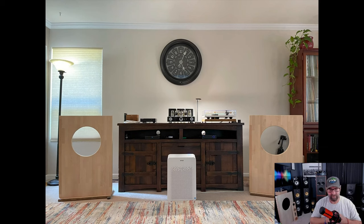So we're going to move on with this project and do some really cool things. We are going to be beveling the speaker hole at about 45 degrees, making a really nice waveguide — maybe even wider — to really help that dispersion and emphasize the waveguide we get from using that compression horn tweeter. We're kind of using that 15-inch driver as a waveguide for that tweeter, making it a horn. We want to extend that in the baffle face to really follow that flare, so we're not closing things up. So we're going to be flaring this baffle.